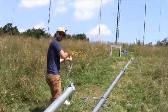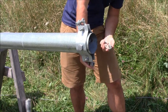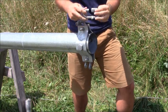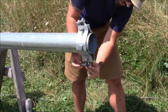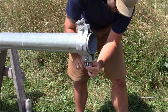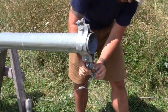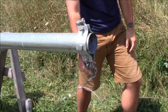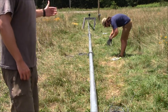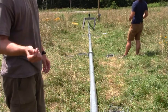Roll it right out to our rocker plate and extend it all the way forward so we don't get kinked up anywhere. At the top of the gin pole at the rocker plate, we've got these shackles and we want to attach this locking carabiner so that we can add our lifting eyelets onto it. Pop that in there and tighten up the shackle. We've already walked out our first lifting guy wire, so add that onto the carabiner and repeat for the rest. It's very important that you attach the lifting guy wires in order from bottom to top so that when you lift the gin pole the guy wires don't get tangled.